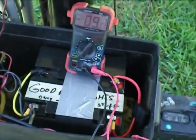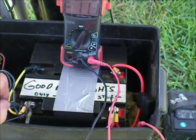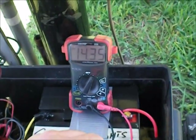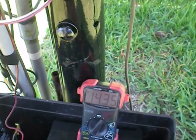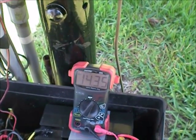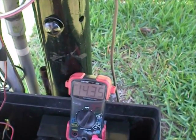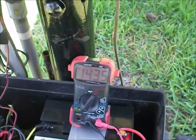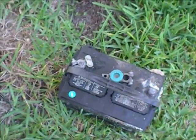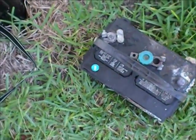That's the battery situation. Those were the two Harbor Freight batteries tied in parallel that wouldn't start cars as jump packs anymore. But as I said, they would run my lights and little lights in the house — LEDs, CFLs, whatever I wanted to run with them. They'd go all night long. I've had them hooked up to the battery bank with little jumper wires to keep them hot, and there they have 14.35 volts. I'm actually using 30 watts of solar panels — Harbor Freight solar — which is probably twice as much as I need. But it doesn't hurt to keep your batteries hot; they last a long time. And as far as this guy down here — seven years later — a moment of silence for him. He's going to go to the scrap pile where you get about ten bucks a piece for him.